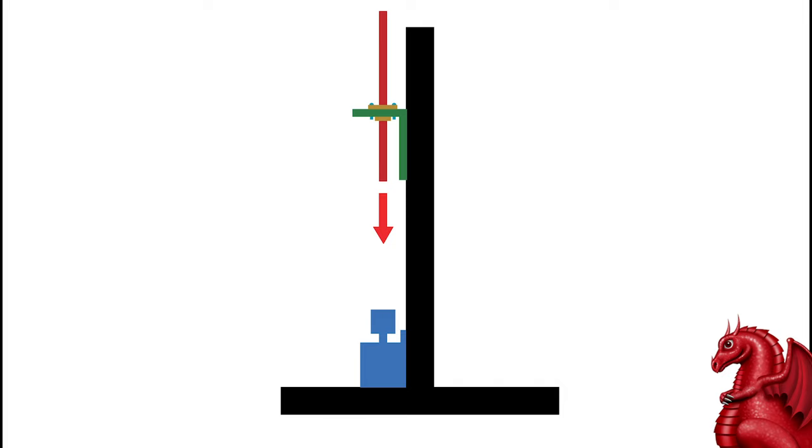Once you have done that, I want you to take the X-axis assembly and drop the screw through it downward until it hits the motor. And remember, your motor is free floating now. It's not up against that rail. What you're wanting to do is see if the motor assembly lines up with the screw when the screw has no play because you've tightened the two nuts on the coupler. It should drop straight down and hit the coupler for the motor mount with the motor mount pushed against the vertical extrusion frame. So it should look like this.